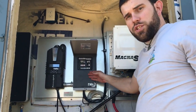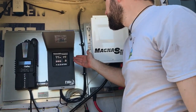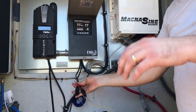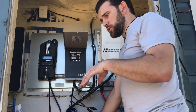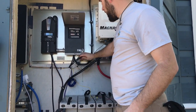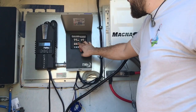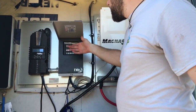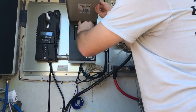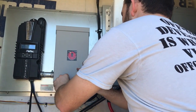Next up we have our OTG board — that's become famous, especially because a lot of companies are trying to knock it off nowadays. What you have here is the input from the solar coming in. We also have an additional setup done for the customer: later down the road when they park this house at their permanent location, they're going to set out five more panels in an array and can do a quick clip in because we pre-wired everything. They can then flip the breaker. These two module inputs are built into the roof of the house, and the last one is going to be for a ground array. Make sure your breakers are always in the right position or you won't have power.